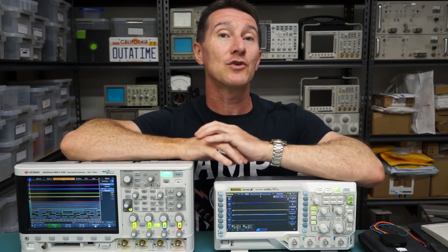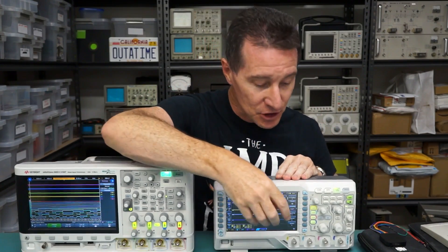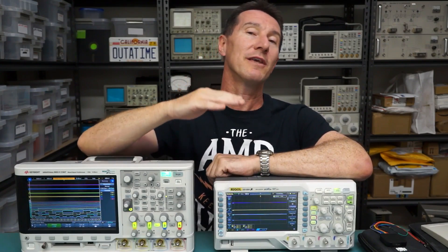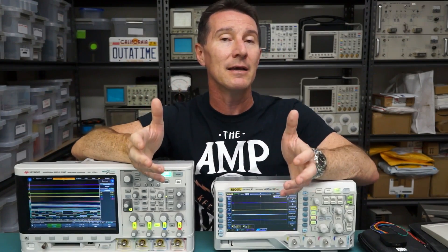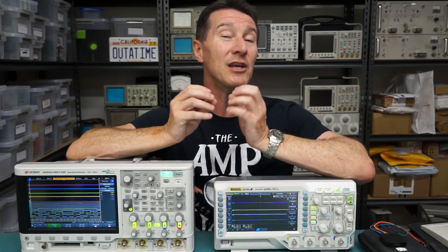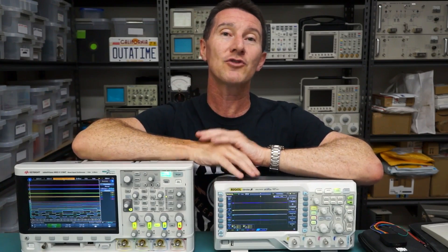Logic analyzers aren't as good as scopes. If you really want to look at a signal properly you need to use an oscilloscope channel — a proper one of these four channels on your scope. You've got to use those; they're better than a logic analyzer, because a logic analyzer will only give you a one or a zero below a certain fixed threshold and it doesn't take signal integrity into account. So if you haven't probed your circuit properly you can get dodgy results on your logic analyzer, chase red herrings until the cows come home, and it can be horrible.